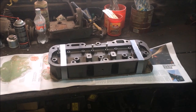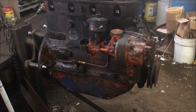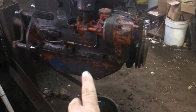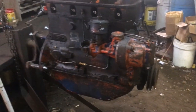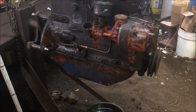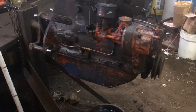About 25 years ago I saved this D17 head with the thought of someday putting it on this engine, and I guess now that's going to come to pass. I still have a lot of cleaning up to do. I've got to put new front and rear main seals, all new gaskets, and besides grinding my intake valves today, the one thing I want to get done is flip this over, pull the oil pan off, and check the bearings. I assumed that when I put new sleeves in this thing 30 years ago I put new rod bearings in it, but I don't know if I put new main bearings in, so I'm going to check the clearances.